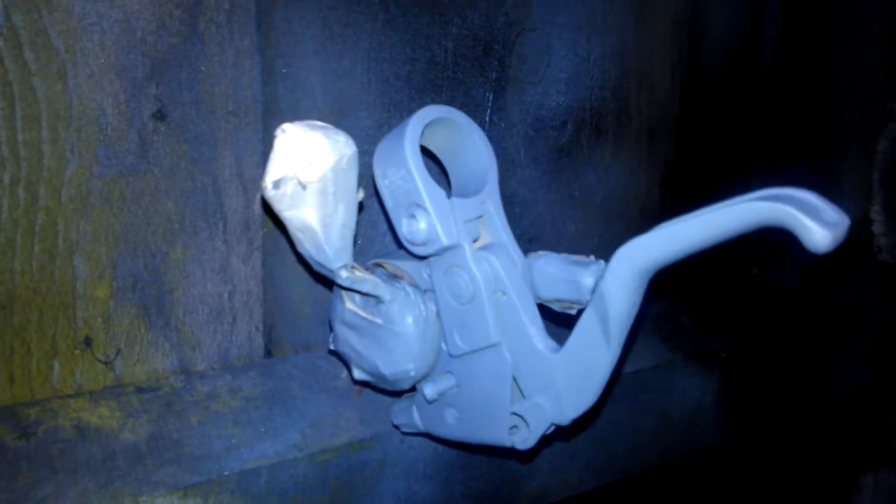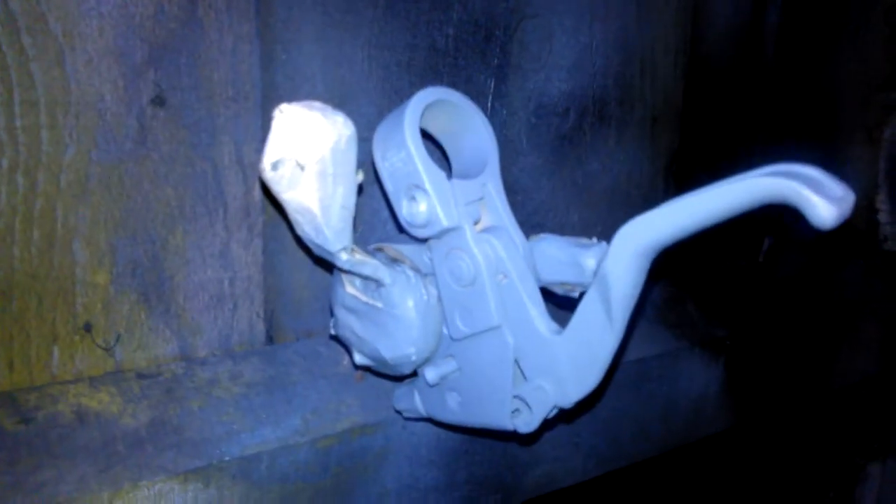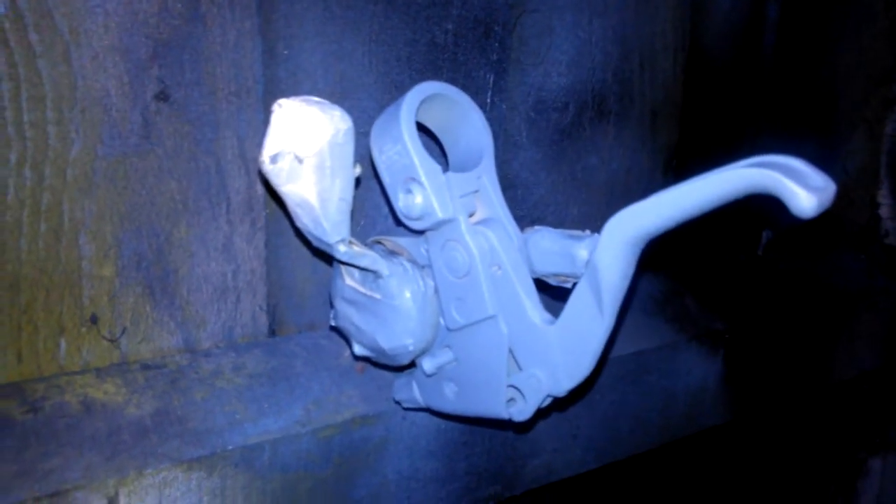Just a little tip for anyone that is spraying metal objects and wants the paint to harden really well. Just take a heat gun or hot air dryer and warm the item up first, especially as long as it's metal, not plastic.